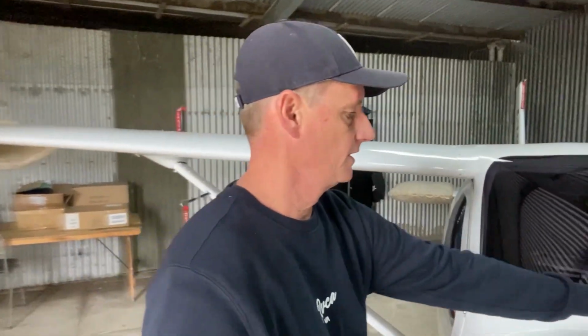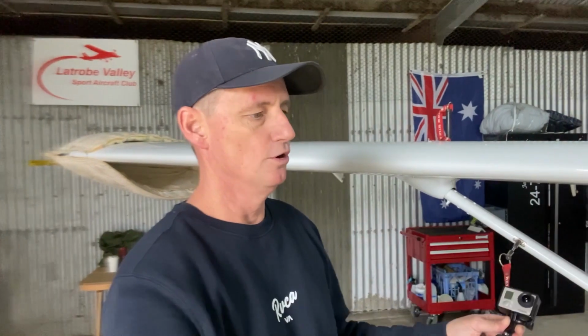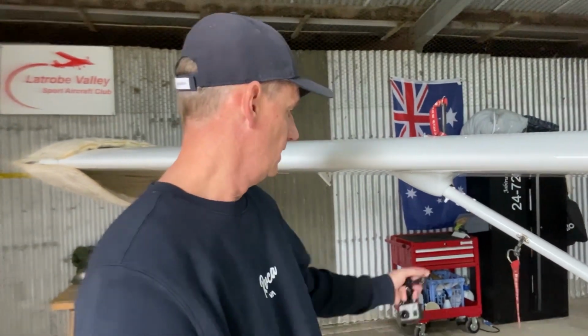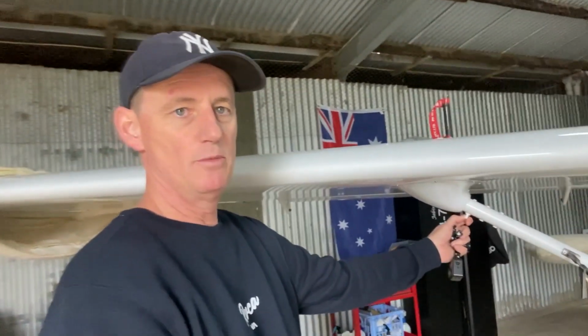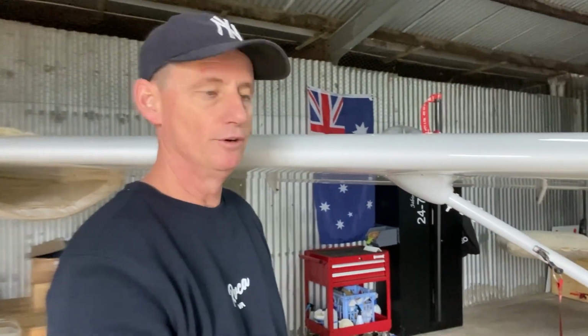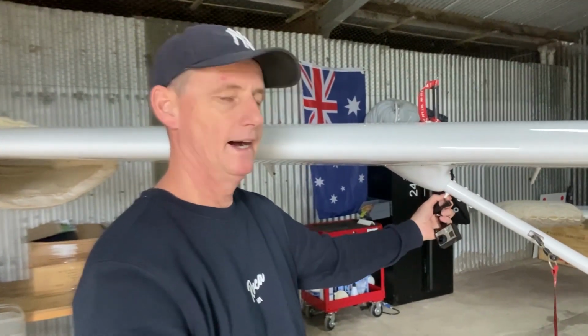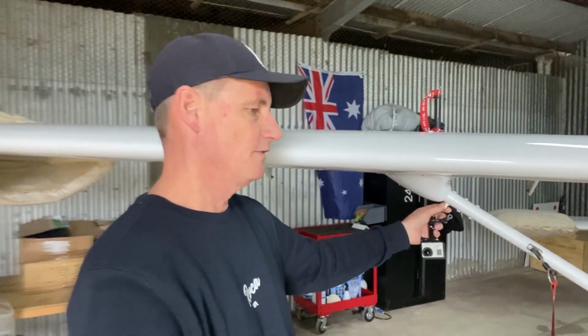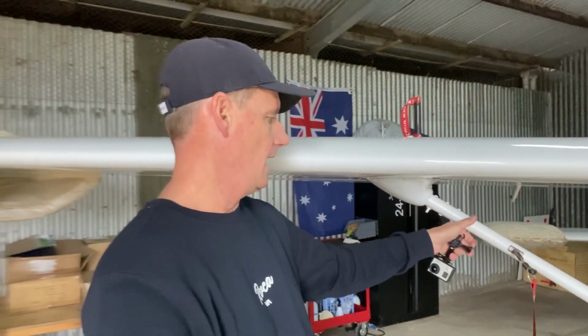In answer to my question, can I simply take this onto the wing strut? No, you can't. Because this is a light sport aircraft, registered as a light sport aircraft, you need a letter of authority from Jabiru, which I'm going to go through that process sometime in the near future. Part of that process will be, there's a tie down point on the jab, so that'd be one good spot. So I'm assuming when I write off to Jabiru or email Jabiru, you need to be very specific. I'm going to use such and such a mount, obviously not this one, but you can buy mounts. I'll put some links in the comments below if you like, specifically for strut mounts or ones that go around the actual strut itself, the aerodynamic or the teardrop section, and strap on.